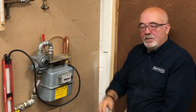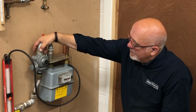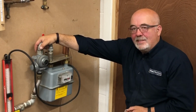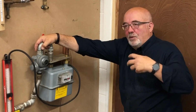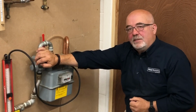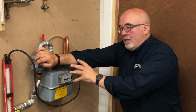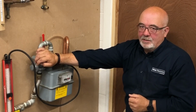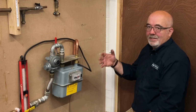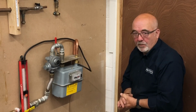From there, we need to do a conventional tightness test. And all we need to do is release more pressure in. Now this time, what you've got to do is take it up to approximately 18, 19 millibars. This one, I didn't find comfortable originally, but the idea is you don't want to start activating this regulator. So by doing it at that slightly lower pressure, it can do a tightness test without any fear of closing that regulator. Once we've established the 19 millibars, we do a conventional 2-minute test, looking for no drop on that gauge.